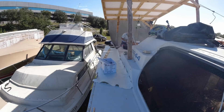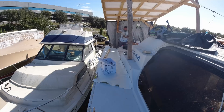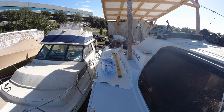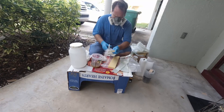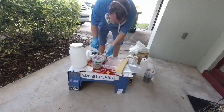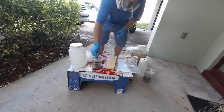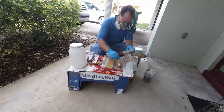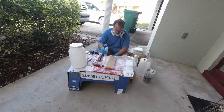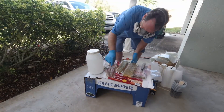Before I did any major structural repairs on the boat, I wanted to make sure that both the materials I was using, down to the specific brands, were just as strong as the original boat. So what I did is I cut a section out of the boat to use as a control, and then I cut several other pieces out and ground them away to do repairs on them. And then lastly, I took one of my new pieces of foam and built a complete new construction using the techniques that I was going to try on the boat.